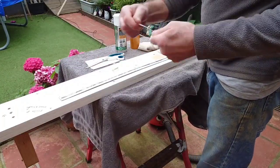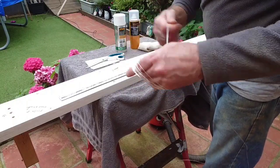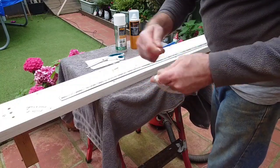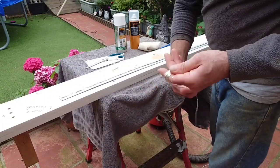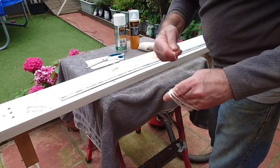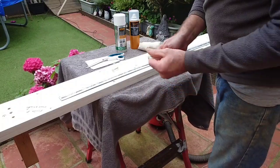I've unwound the old one and just copied the wire — cut it to length. Now I'm just winding it up for the minute, and then we're going to be insulating it with our enamel spray. We're going to give three coats of enamel spray and off camera I'm going to make sure it's all covered extremely well.